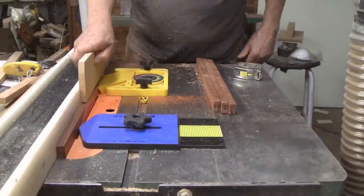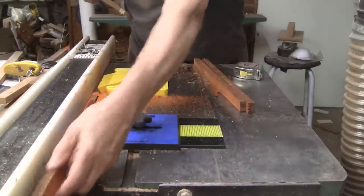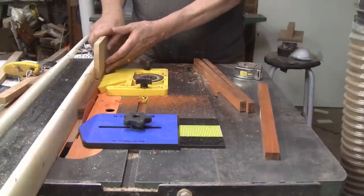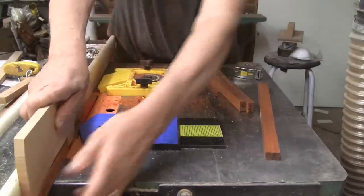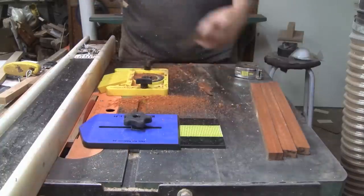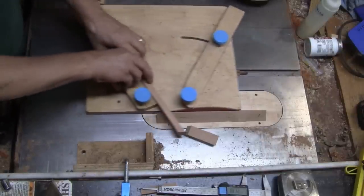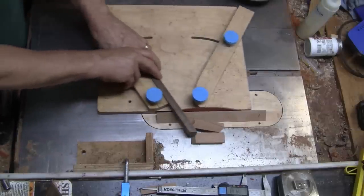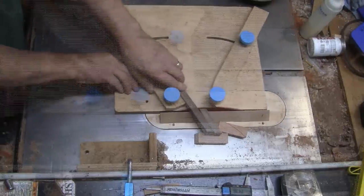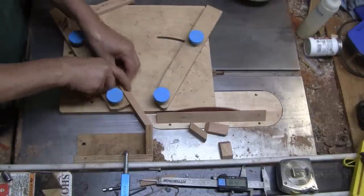I'm cutting all the pieces to the width I have on my drawing. It's very important that all the dimensions are the same across all the different woods and that it matches your drawing. But if you measure the pieces and they're not matching the drawing, adjust the drawing to the width you have - you don't need to recut them. The width is critical because when you stack two next to each other it might be larger or smaller than wanted, and pieces that butt up against them may not fit.